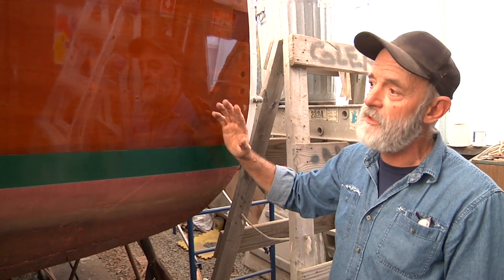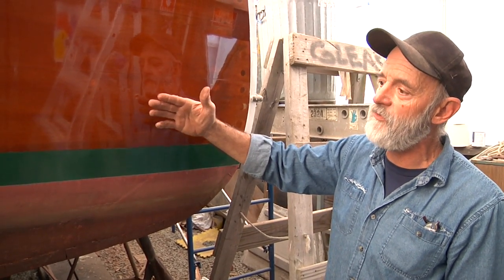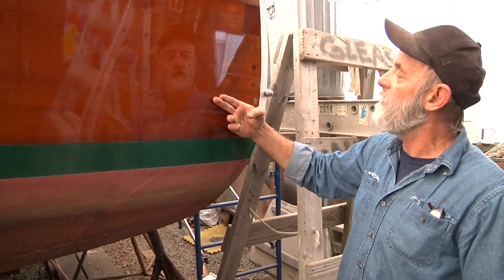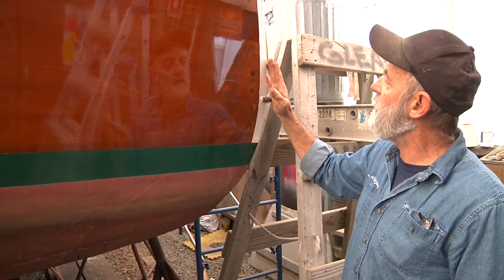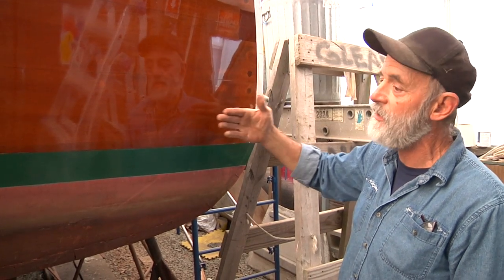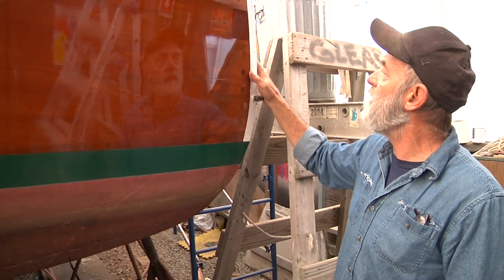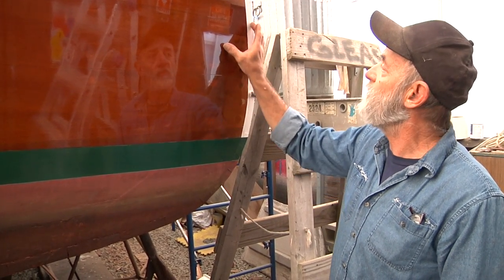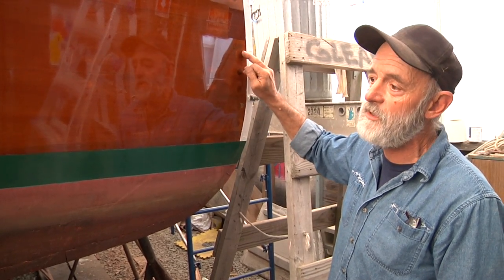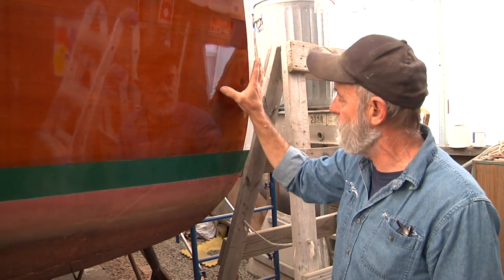I don't know how many layers there are because I haven't looked inside, and I don't know if the wood inside matches the outside. This is not an overlay transom, because if it were, the planking would extend past the side planking and you'd see a seam down the side. So if it's been replaced, a layer was taken off and a new layer put back on. Since then they may have had trouble with the corner posts — the framework — because I don't think the screws were holding, which is why it's been rebolted. On the other side it's the exact same thing.